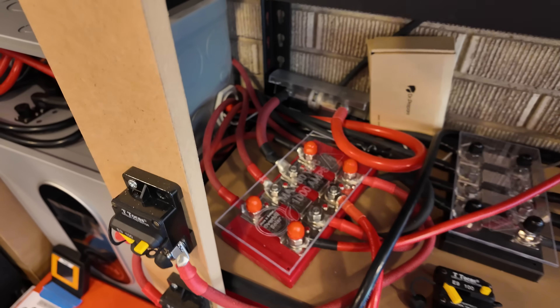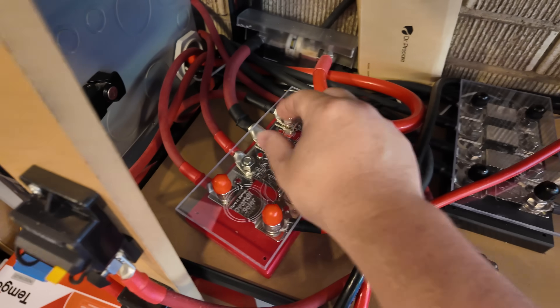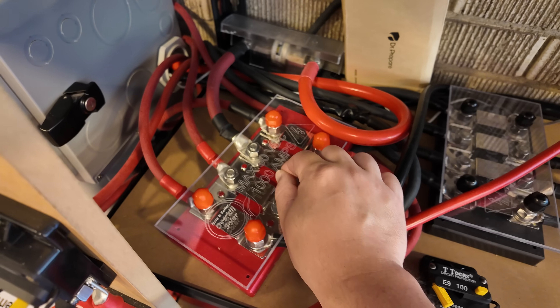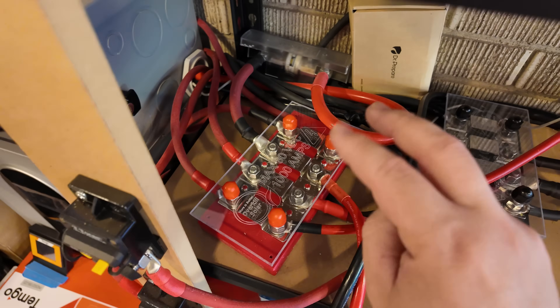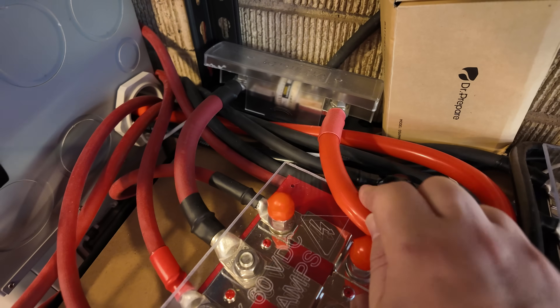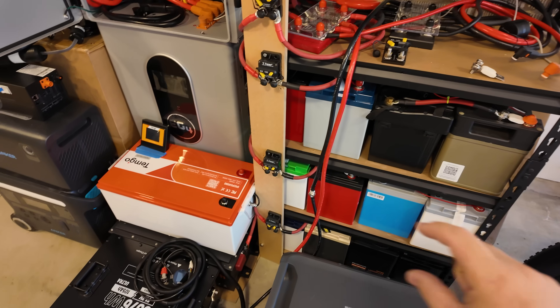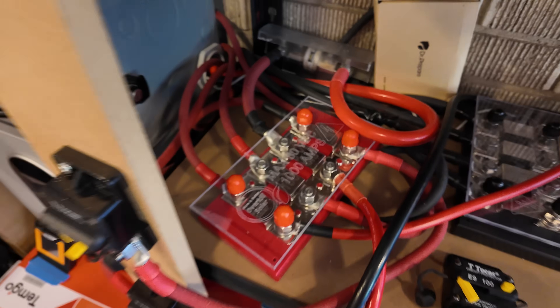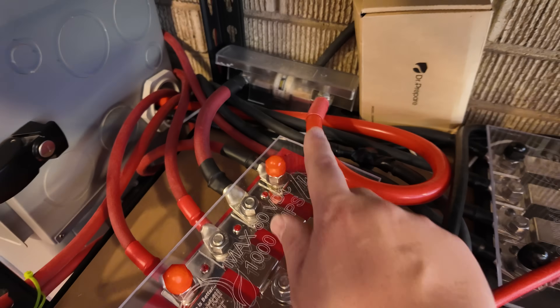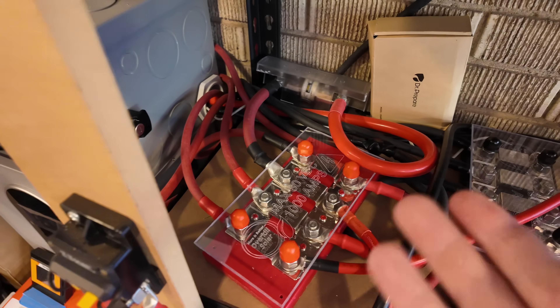This main wire is going through a T-class fuse, which can extinguish DC arcs exceptionally well. After I combine all of my batteries together on these bus bars, I step up the size of the wire because I'm getting closer to that fire hose size — bringing in all these garden hoses and combining them on the bus bar. Then they flow out through a larger hose that can carry more current, with a master valve that has the capability of disconnecting substantially more power. Technically, if we added up all the current this battery bank could produce, this 2-0 gauge wire is a little small, but I've downsized the fuse to only 200 amps.